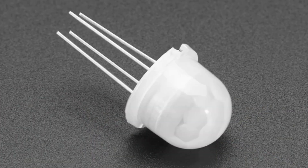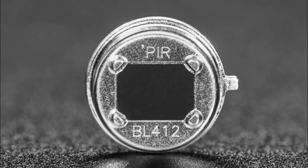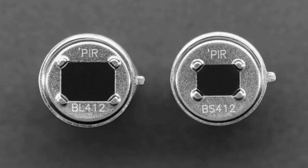Next up, these adorable little PIR sensors — oh, they're so cute. This little PIR sensor is interesting. It's a fully integrated PIR module but in a tin. Normally you get a PIR module with the infrared sensor, a lens, circuitry, and logic level. What's interesting about these PIRs is there's two: the one on the left is the BL412 with the large window, and the one on the right is the BS412 with a narrower, smaller window. I tried both — they both work pretty well, but I know people have preferences.